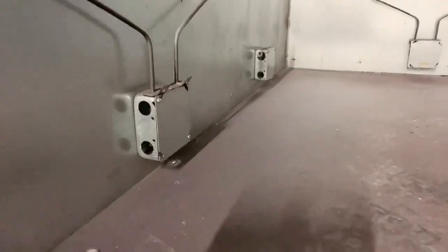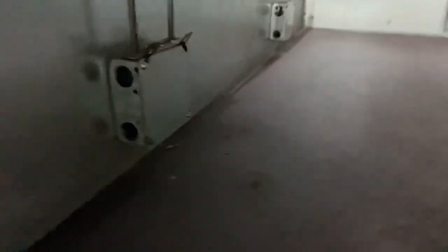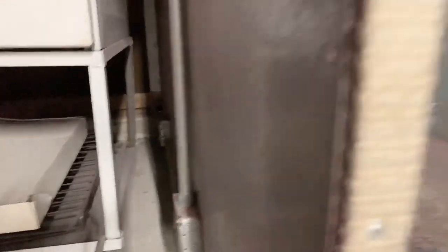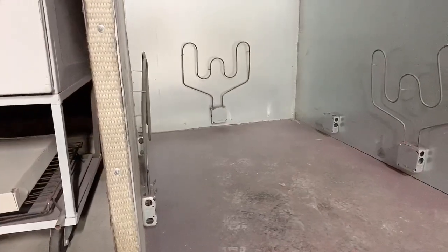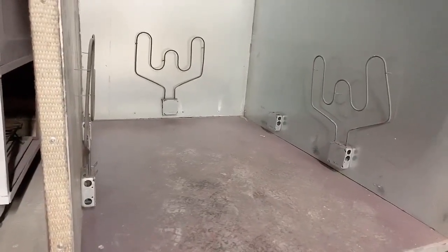As far as the wiring on my oven, the heating elements — the wires — it's only two wires inside that box. On the outside, the wall's only two inches thick, and I put another box with an access panel, and that conduit runs to the next box and so on all the way around the oven to the other three and back. I've never had a problem with the wires getting too hot, melting, nothing. The oven works great.